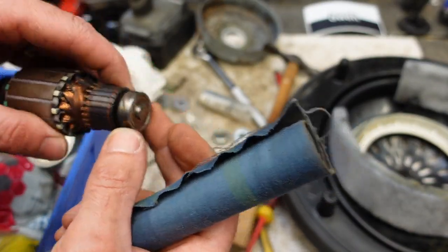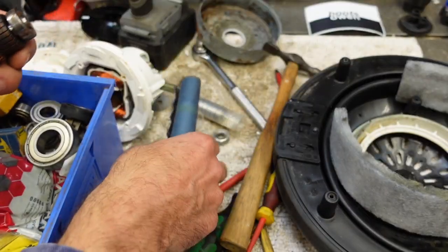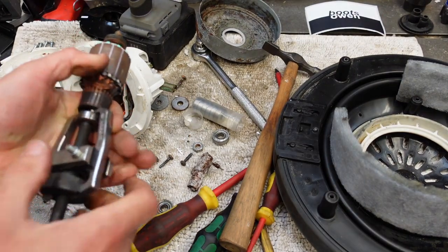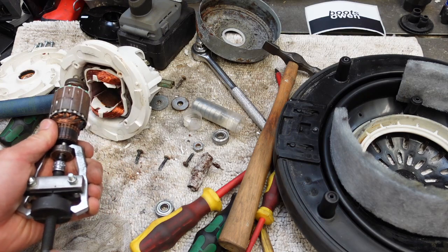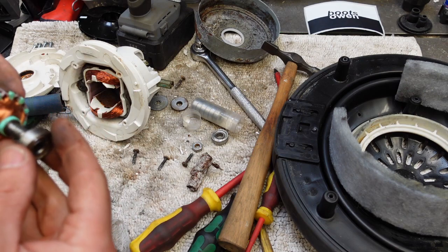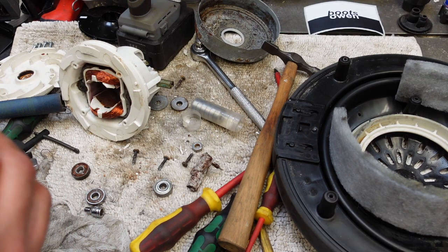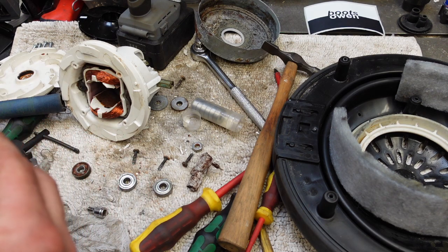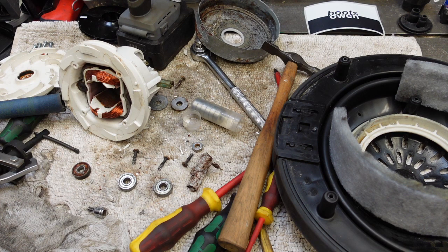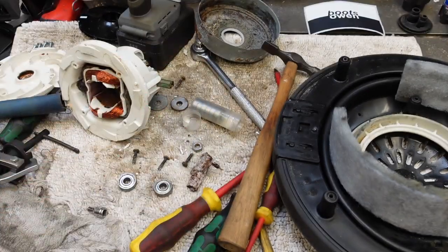So the bearings are the same as skateboard bearings or roller skate bearings - 608, 608 double Z. So I'll put a new bearing on it and I'll give it a clean with some emery paper. It's moving anyways, so now I just need to put something small in there. There we go, it's coming at last. That new one's a sliding fit which is not great - very strange, but it should be. I'm sure it's as good and as bad in that case. I can put that bearing on there, swap them over - that might give it a bit of a better fit. It's not great though. I don't know why some 608s would be loose and some not. I'll just try switching them over for now then. I'll press those on in the vise and give this a polish.